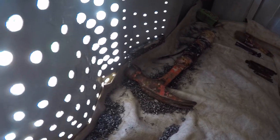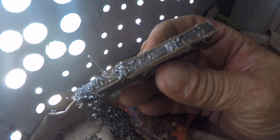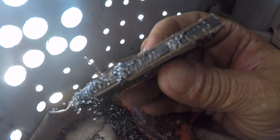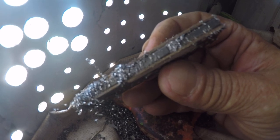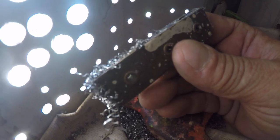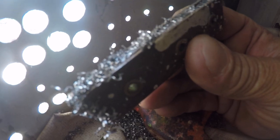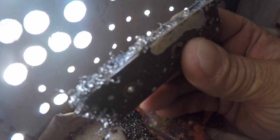This magnet is here so you can see the size of the shavings. If the shavings are too small, it means either the hole is just starting, the drill bit is dull, or you're not applying enough pressure. When you get longer shavings, that means the drill bit is cutting at an acceptable rate — you're applying enough pressure and keeping the bit cool enough.